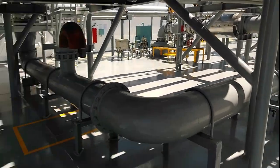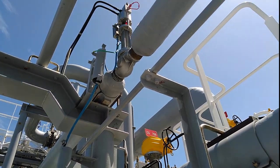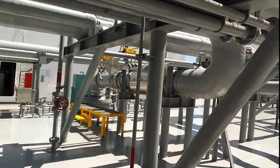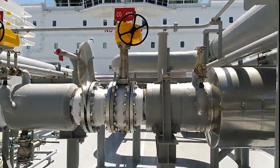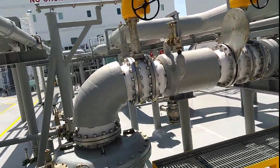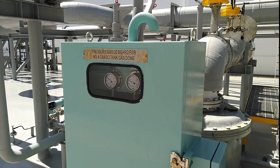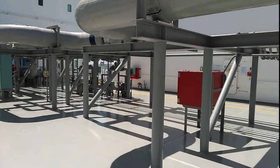This valve is opened if required to supply LNG inside the sub cooler room. Passing the inlet gas line, this is the vapor dome of cargo tank number four — you can see it has signs of frost because we've started cooling down. The low duty compressors are sucking and extracting the vapors, so it becomes colder and colder as we perform the cooldown operation.